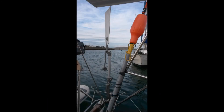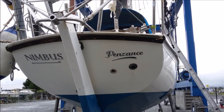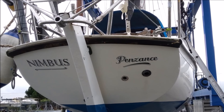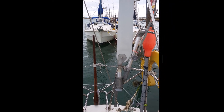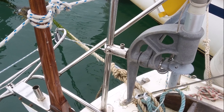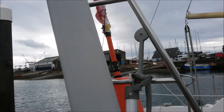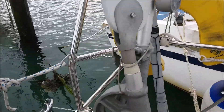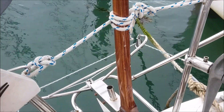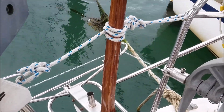Replacing the wind vane was straightforward. A u-shaped tube mounted horizontally to the stern cleared the rudder. This was braced to the push pit by two struts. When berthed I wanted to lift the unit out of the way of the mooring lines, so I fixed a secondary mounting boss on the push pit. I can stow and lift the whole unit easily by undoing a single bolt, moving it from one boss to the other.